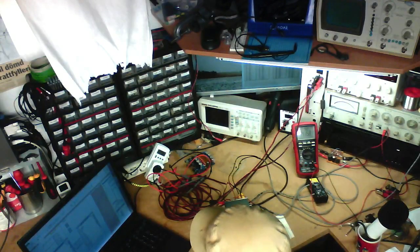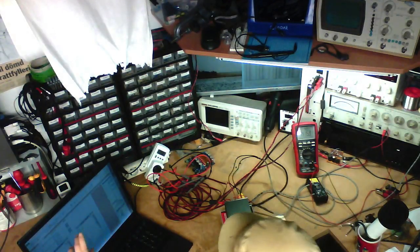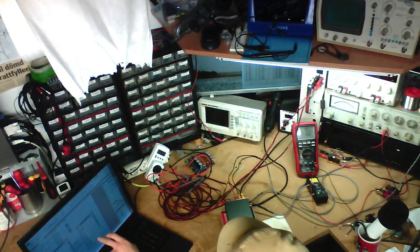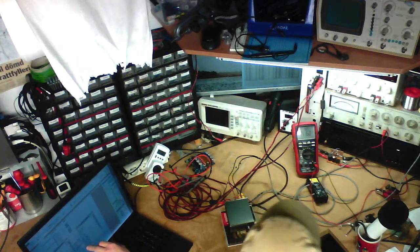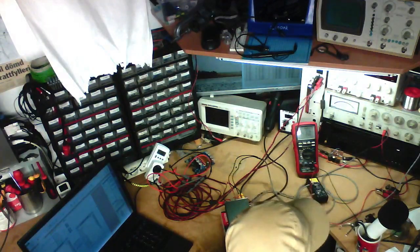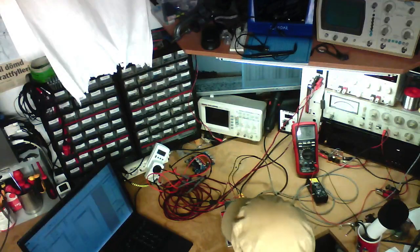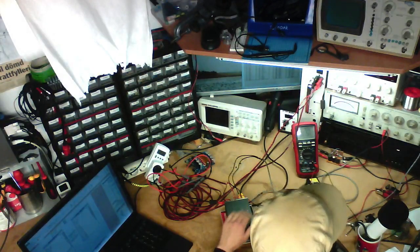Yeah, now I have to redo this spreadsheet, the power section, for every amplifier test, since I need to have a different power range, and I've clearly not anticipated going beyond 25 watts on this one, because the next step up is 80 watts or 25 volts. And we've only got a 19 volt supply voltage, so it wouldn't ever go above 19. So I'm just going to end it there. It starts clipping at about 20 watts per channel, which is really not too bad at all. That's about what you'd expect.